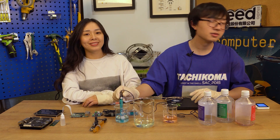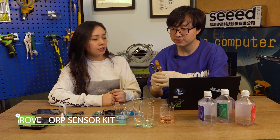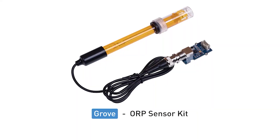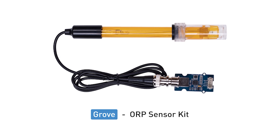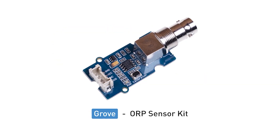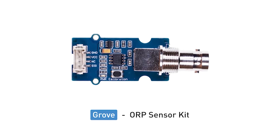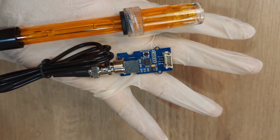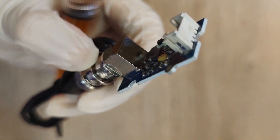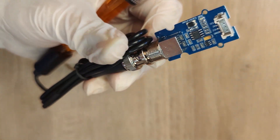That's all about this experiment. Next, we've got another water quality sensor — the ORP sensor. ORP sensor means oxidation reduction potential sensor. It measures the activity of oxidizers and reducers in a liquid, and the ability of a lake or river to clean itself or break down waste. The Grove ORP sensor works for both 3.3V and 5V systems. The Grove connectors and the standard BNC interface make it easy to use and very suitable for Arduino and Raspberry Pi applications.